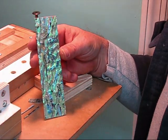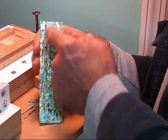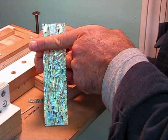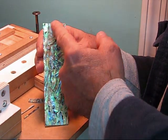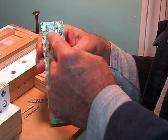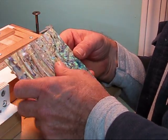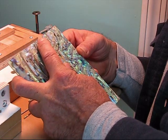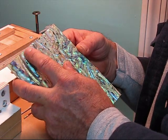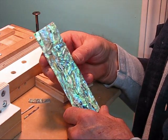The reason I cut cross-grain is that when I inlay the pieces, the little grain lines are going one way, but the cuts — the joints — will be going the other way. So when you butt them up against each other, if there's a joint there, it won't be as noticeable because of all the other little lines going that direction. It helps hide the joint. If you strip them the long way, you could possibly run across a streak there.